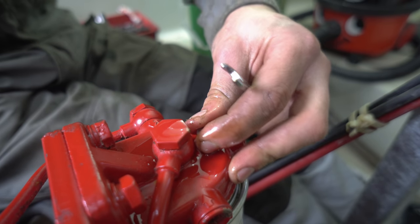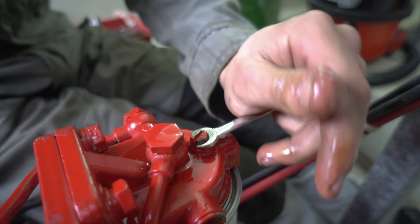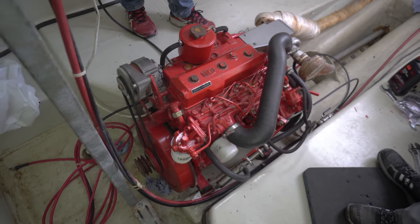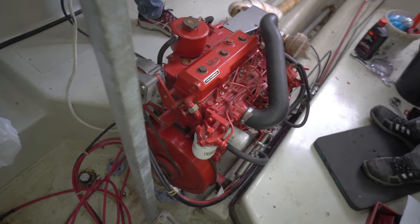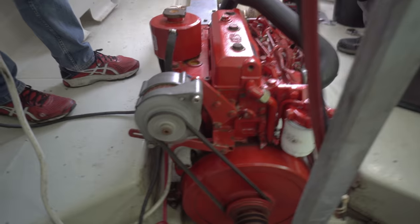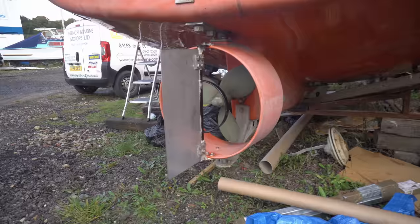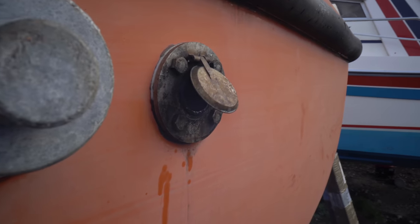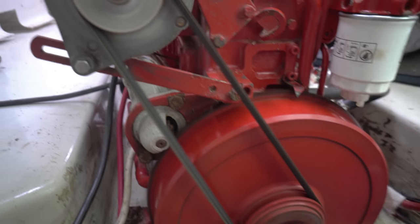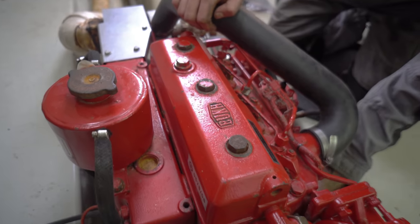Good news. Aside from the cosmetic dings and surface corrosion from a few years of storage, Alan's DV48 was awarded a clean bill of health. Small puffs of white smoke quickly dispersed as the engine warmed up. The electrics, aside from a dead alternator, did all their jobs too. And so I planned to give the engine new fuel filters and hoses, a good wire brushing, and then fresh paint a few months later to stave off corrosion.